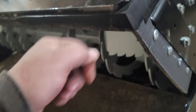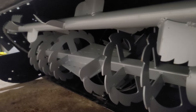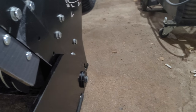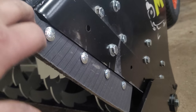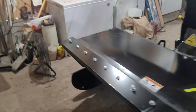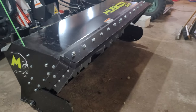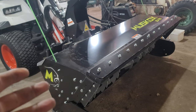I think I've shown you the dual augers in there — it just chews stuff up. These sides move, but this UHMW on the side is probably going to need to get replaced before next season, which kind of sucks that it's so quick — but that's not their fault, that's mine from learning. The biggest thing I'd change: it's a snowblower, it's extremely slow. If you have long driveways, you're probably going to want a box pusher for that. But when you use blades and boxes and start building up a pile, that's when you come get your snowblower and start getting it out of the way.